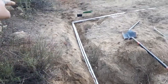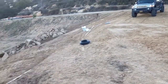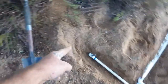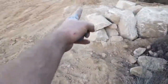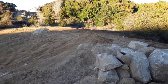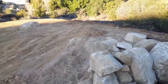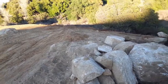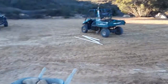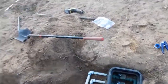That drip line is going to snake all along this edge, and that's where the ground cover will be planted. Then it's a T because I'm going to take the T and run it about a hundred feet that direction. It wouldn't make sense to run it with poly tubing — I'm going to run it with hard white pipe, dig a trench buried underground, and then do more drip tubing over here. I can put little holes in there and put little emitters.